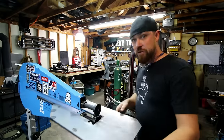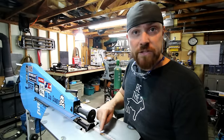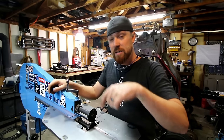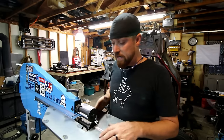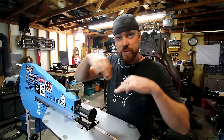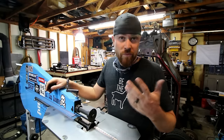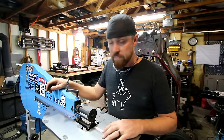One of the other things I wanted to do was, on this plate, I put some 1/8-inch holes, about a 1/2-inch apart. Like with aluminum, a lot of people use dimple dies. And I think with this thing, I might be able to give something a dimple die look by basically finding the center, drilling an 1/8-inch hole in it, put a Cleco in there, and then just run this thing, and it should make it do a circle, contour the edges, and then I can cut the inside out, and it may look dimple die-ish. So that was kind of the idea behind this too.